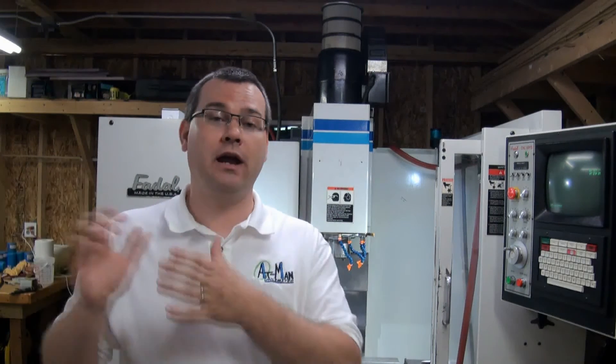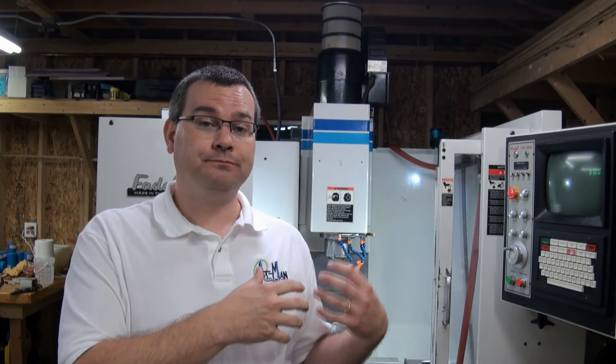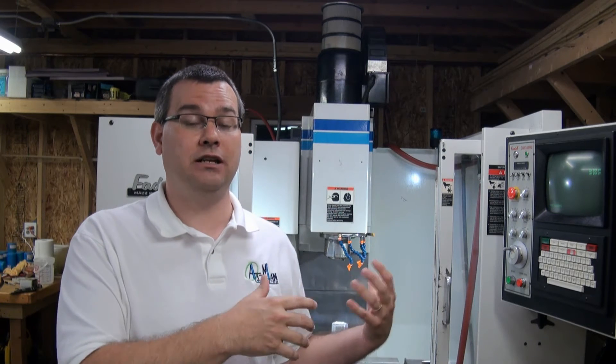Along with the cost of repair and purchase of a vertical machining center, or buying a brand new personal CNC machine, we also have ancillary costs. Installation is going to cost a lot more with a VMC — the wire needs to be bigger because of more power, and getting the machine into the shop will cost more. If you have to hire a machine mover, they're going to charge anywhere from $1,000 to a couple of thousand dollars depending on the job. With a personal CNC machine, probably a couple of your buddies will be able to get that into your house.